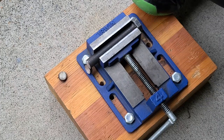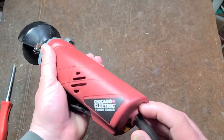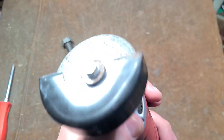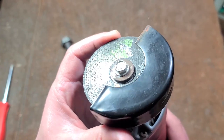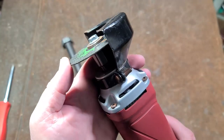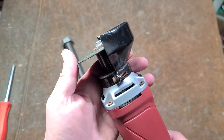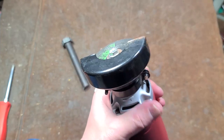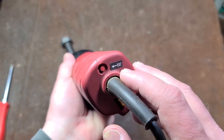Pretty dramatic difference. So that was the performance. It did cut out once on me and I just had to not press as hard — I had to go pretty light to prevent it from cutting out, which slowed down the cut. I'm only using one of the Harbor Freight 60-grit Warrior wheels. Harbor Freight has two types of wheel thicknesses: a 3/64th-inch thick wheel, which is what this is, and then they have 1/16th-inch wheels. I do not recommend the 1/16th, the thicker wheels, at all. The extra material it's cutting off and the resistance would make this tool basically useless — you just have to barely press to prevent the thing from overloading and kicking out the circuit breaker.